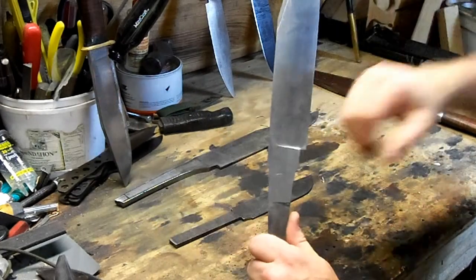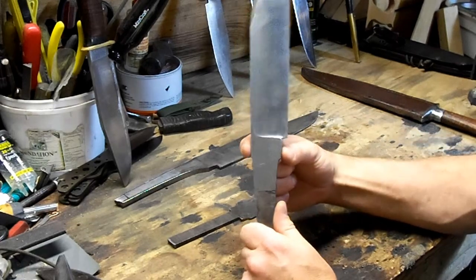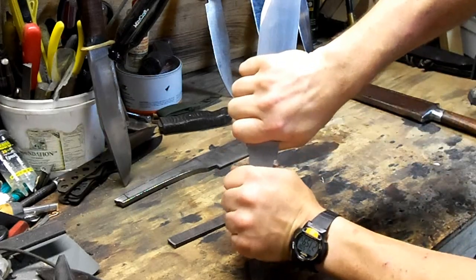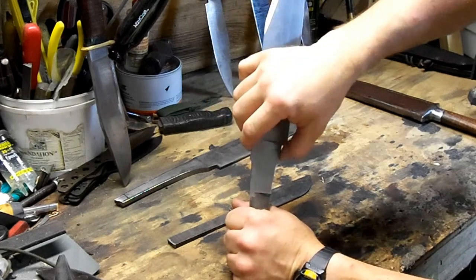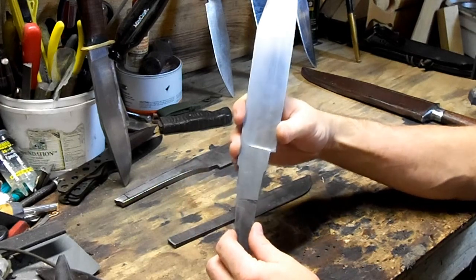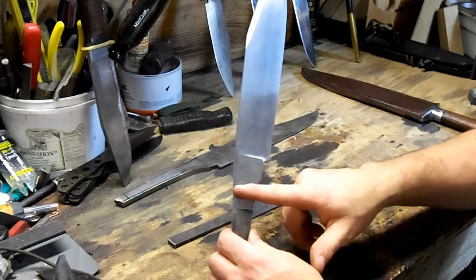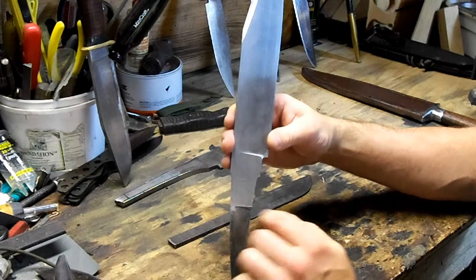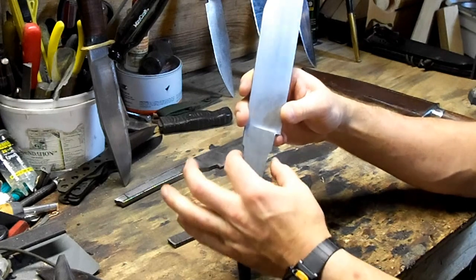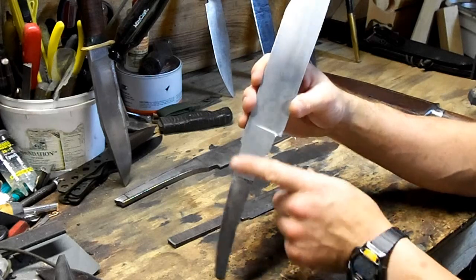So let's talk about how to make a good narrow tang. Here's the bowie knife blade. You have a fairly wide ricasso, and your tang transition is fairly well done. You've got 80-90% of that blade's width right there — just a minimum step down to transition from the ricasso to the tang. When I mount the guard on this knife, I'm going to take very little material off this. I'll leave it as wide as possible and then slowly taper it. I might relieve some of the tang down in here to fit the handle, but I'm not going to mess with the tang transition.